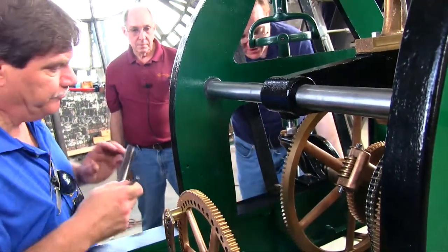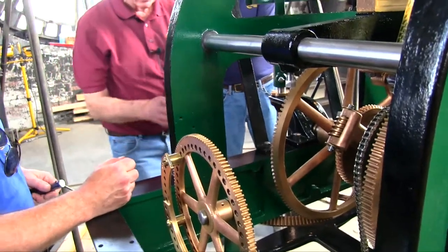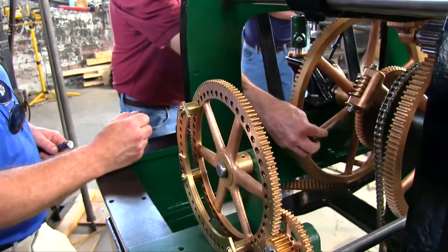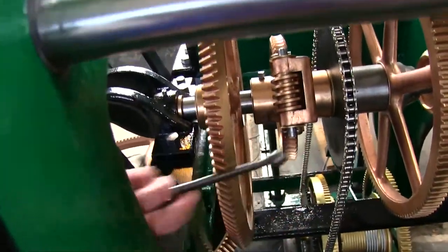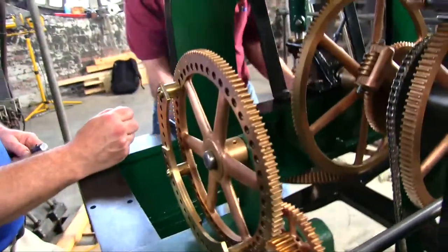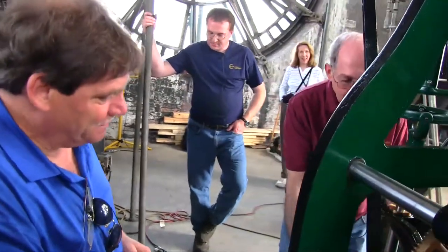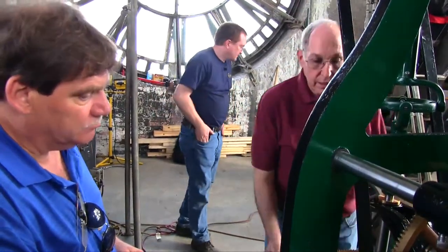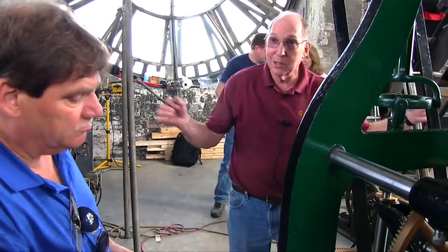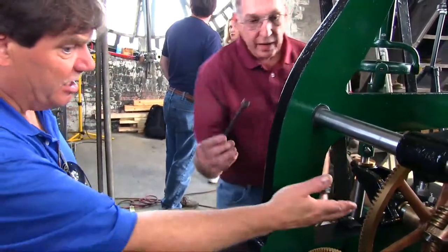If you had to advance three hours, I don't think you want to sit there and crank and crank. See, there's a T-wrench — it goes right onto here. You can loosen all three of them; once they're all loose, you can turn this and it will turn them. But it's better to do it with the worms. It takes a tug because you're turning everything — once you get it going, it's all balanced and it's going to move. So just be careful when you do it. Your rough adjustments are there with the T-wrench, and your fine adjustments are there.